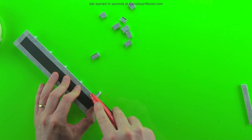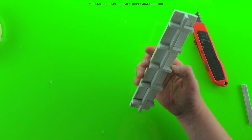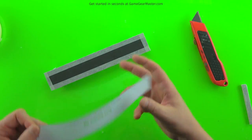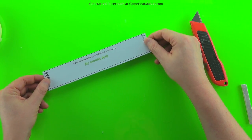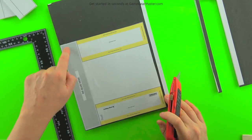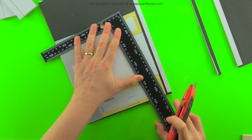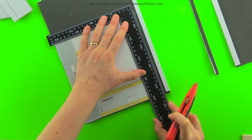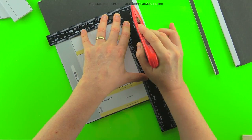And there you go — one finished grid tile jig. You can also put on the top part of the grid tile jig, and I recommend wrapping that in tape as well to hold it down. Then it's time to make the scoring sled jig. I've glued it down on foam board just like with the grid square jig, and we're going to cut it out the same way around the outside edge with multiple cuts to get a nice accurate, clean edge.